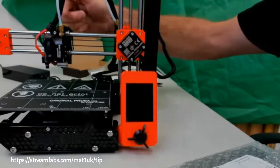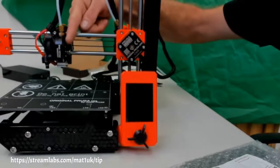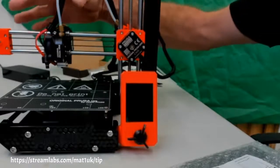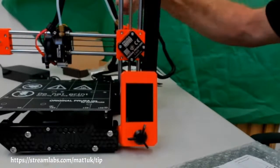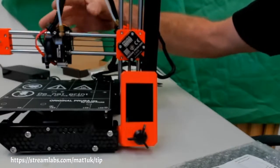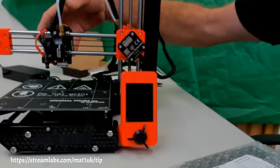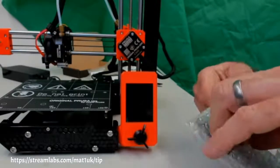When they went to that, we then started having a difficulty of what do we call this, what do we call that? Is it the bit that pushes the filament through, is that the extruder? Or is it this part here, because that's the bit that extrudes the filament? So it pushes the filament out. So it became difficult because, like I say, originally the word was designed for a one-piece unit where it was all together. But the problem is when you've got all the mass of the stepper motor and the gears for the extruder part on here, when that's moving backwards and forwards, that's an awful lot of mass. And what that tends to do is to cause issues with your print. You get ringing and ghosting and one thing and another because it is moving so much weight about. So this Bowden system was designed to keep the weight down on the print head, so the prints were a better quality with less ghosting and ringing. So that's where it sort of stems from, I seem to remember.